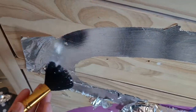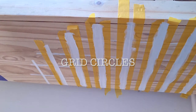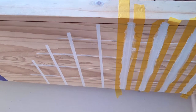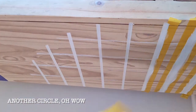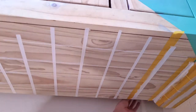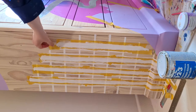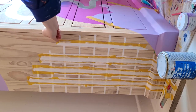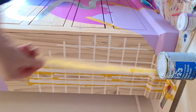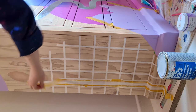I have the footage sideways here to show you me peeling off some tape. I drew another circle on this side of the chest of drawers, then drew out a grid with a Posca marker — but I decided the lines weren't thick enough, so I masked up some lines. I eyeballed all of this and didn't measure, but my eye told me if it looked wrong. I then primed each stripe and used a white eggshell.